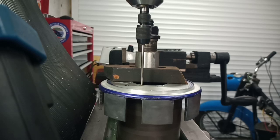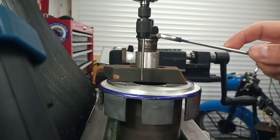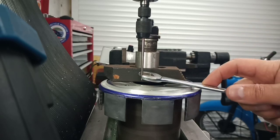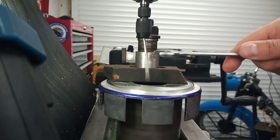I've spotted all six of our chain wheel rivet holes, and we're going to drill them. So yeah, there you go. It's not kicking off to the side. Basically, it's like a pin chuck. There's a ball end, and it's free to move from side to side. So if we just knock him off centre, you see, off he goes, like some medieval torture device.